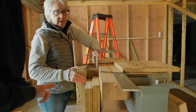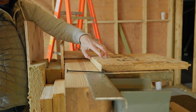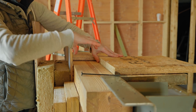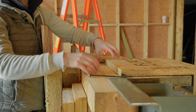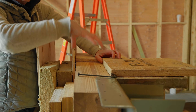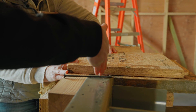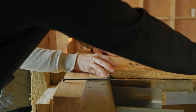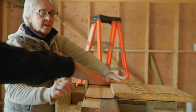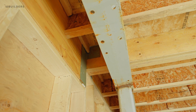Right above the deck, let's say the decking boards are six inches below the finished floor inside. We have a one-and-an-eighth inch Advantech, and we're cutting away that Advantech as it goes over the LVL on the outside because we want to sink the door frame down a bit — from a sightline standpoint it reduces that sight line. Typically you'd see that subfloor running all the way to the edge of the framing. There's actually a snap red line which is the window line, and they're going to cut that piece back, then land the lift-and-slide door directly on the tripled-up LVL.